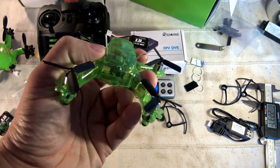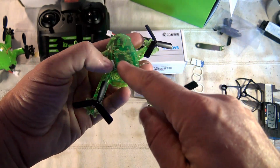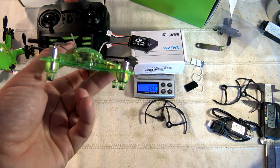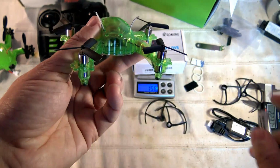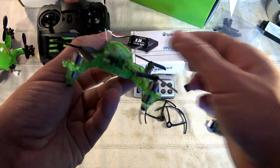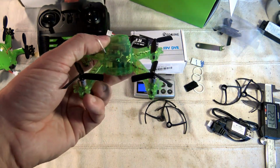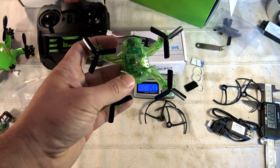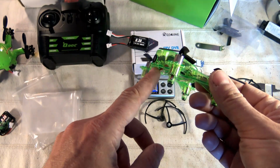So the left one is associated with the 5.8 GHz chip, which is installed on top, okay, and the right one is the 2.4. Look at that. Installed here, okay, this is the main board with, at the bottom extremities, the RF module, and the right antenna is the 2.4 GHz antenna. So the distance between, okay, is not so bad, but here it's installed vertically, and that's great.